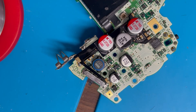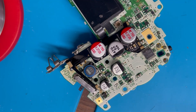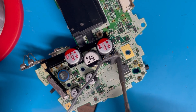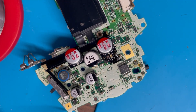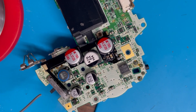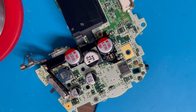Get it into a rough position — I like to start with either the bottom corner or the top corner. It helps to also pre-tin these pads on the de-hum kit itself, so you can put solder on each pad. This helps you then work with the tweezers in one hand without having to hold solder in the other hand.